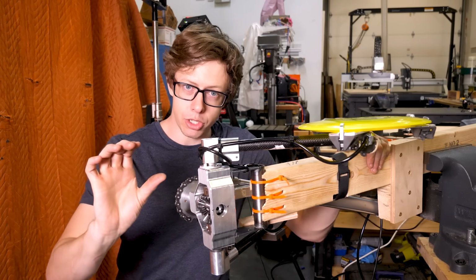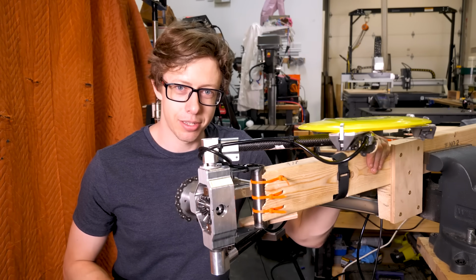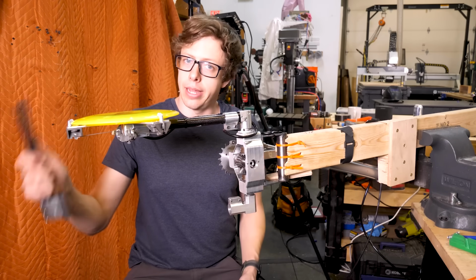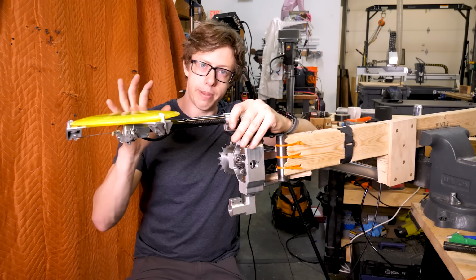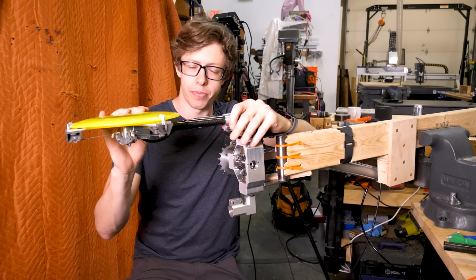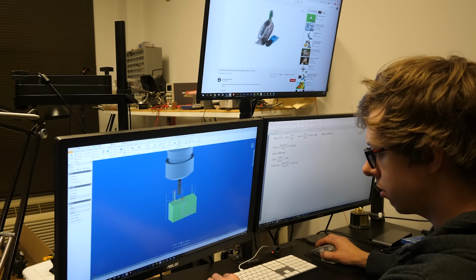So I calculated how much torque this would put on your arm, and it's about the torque output of a Honda Civic. So I'm gonna remove this lower arm. This will cut the torque in half, although it does mean we're gonna get the kick that I was trying to cancel out. So to try to make that better, I'm gonna make all the mass removing up here as light as possible. The downside is I have to redesign and remake everything that moves. Yeah, that's not great.